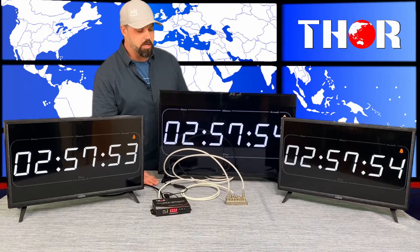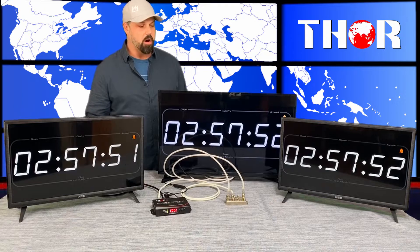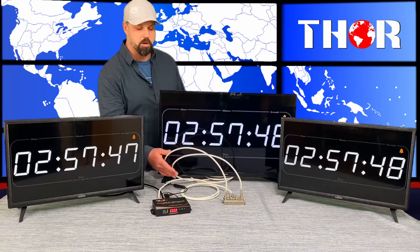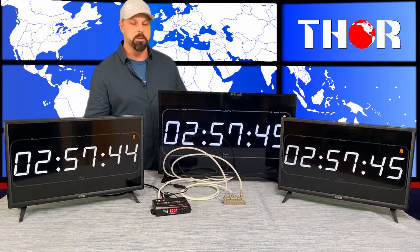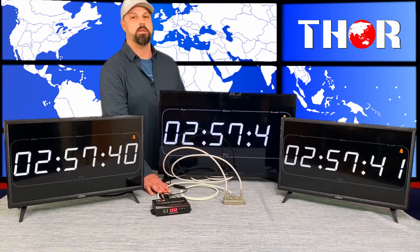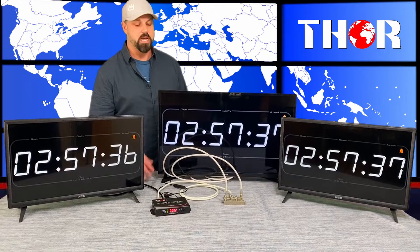So essentially this is a basic architecture you could use in your house, in a bar, restaurant, or some smaller scale applications. You can always use RF amps along with a splitter — you can split the signal as many times as you want depending on how many dBs you have. Our petite modulator has about 30 dB output, which should be more than enough to cover about 15-20 TVs, again depending on the loss in your coupler and splitter.